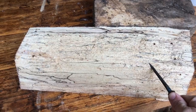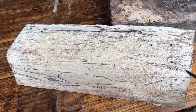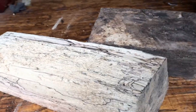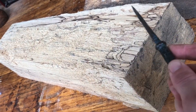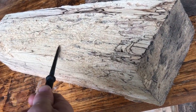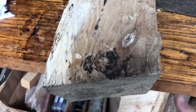How long do you let it sit? It's kind of always a tricky question. This is some of that maple I was cutting on earlier, and this is a good time to talk about the age of the tree and heartwood versus sapwood. Sapwood is going to spalt and decay a lot more quickly. This maple tree wasn't really a big tree, and I think this was one of the early ones I did an exploratory cut on. Here's the outside of the tree, and the other edge on the outside surface is over here, so the decay was coming in from this direction. Part of this is very solid — you can mount your chuck to it, it'll turn fine, but there's not a lot of patterning in there.